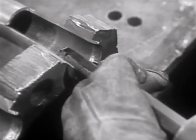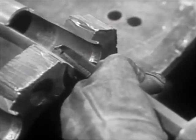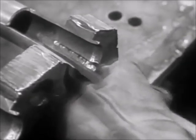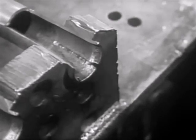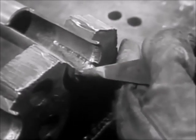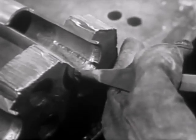Now use the round nose gouge to cut two grooves inside the tube at the marked points. Be careful to hold the gun and gouge parallel to the tube wall. Start each cut about three sixteenths of an inch from the outside edge of the belled tube. Be sure to start the cut lightly until the tool has wedged into the steel. The cut should be only about half of the tube wall thickness — a depth sufficient to permit the tube to loosen within the tube sheet.